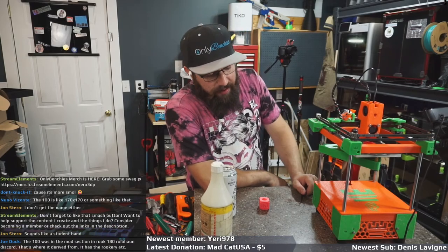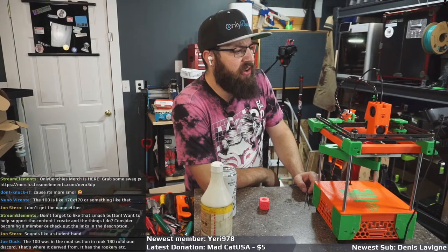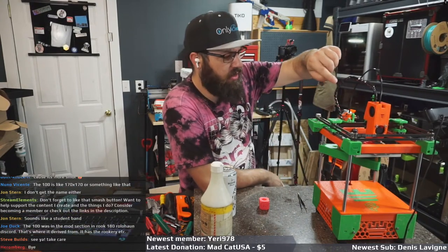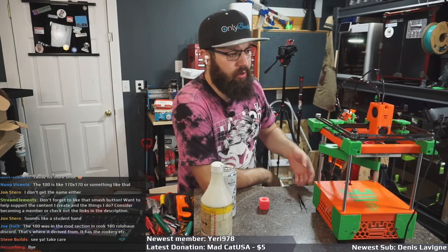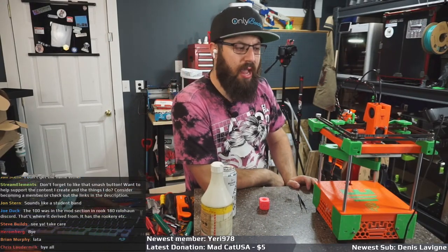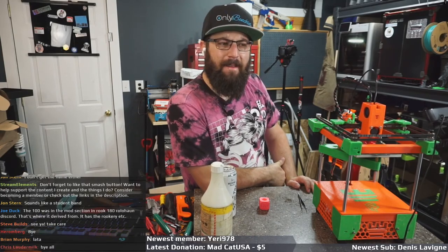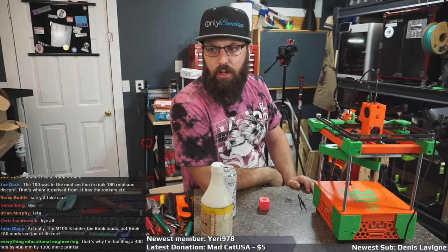This was a fun build. There were a few little quirks to it. It's very much an in-dev thing, in my opinion. I had to redo a few of these parts because the nozzle didn't reach past the fan shroud and the fans didn't spin because they were hitting. It's not a fully mature design, but it's at the point where if you wanted to build one of these and you kind of know how a 3D printer works, it shouldn't be too hard.